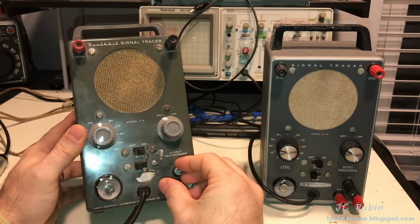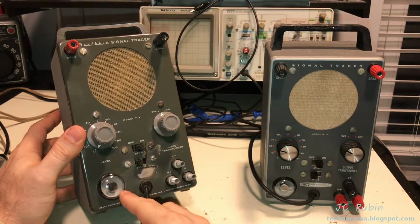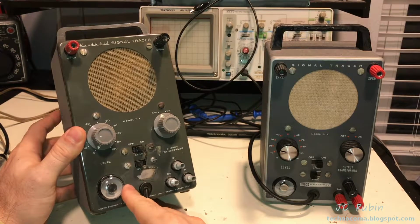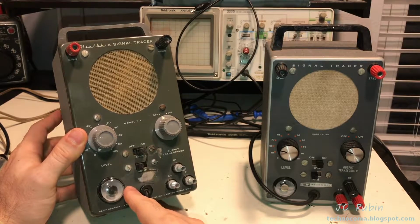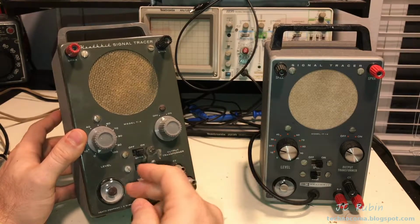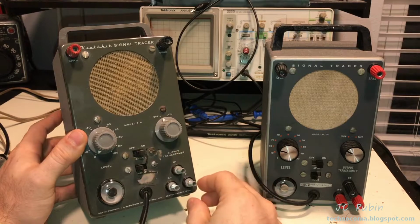So for the cost of one more vacuum tube, the question is, does it come at the expense of this Magic Eye? I won't know until I budget it in and then take a look with a milliamp meter, see how much current is being pulled, if it's too much or too little, and then make the decision: does the Magic Eye tube go to add the vibrato, and end up putting that right there.